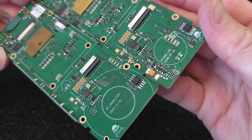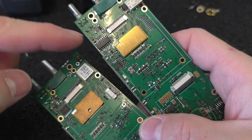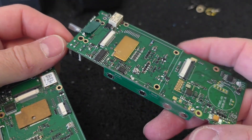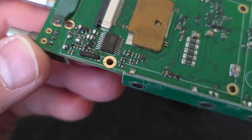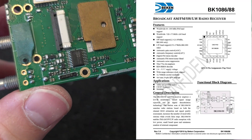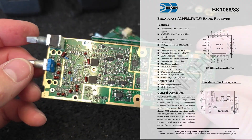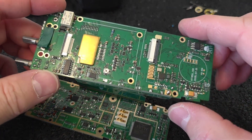The main difference is the receiver - the HF receiver chip. This is the SI-4732 receiver chip, which is used in the new RT 950 Pro. And this is a different chip - 1088, I think. So this is used instead of the SI-4732. And maybe this is the reason why the shortwave receiver is not working well - it's actually very deaf on short waves, middle waves and long waves. I don't know why - I tested it on long waves, middle waves and it's not working. But the Pro with the SI-4732 is working very well on short waves.